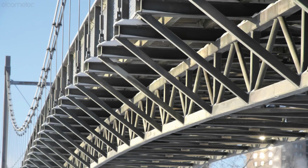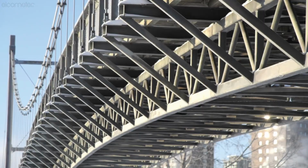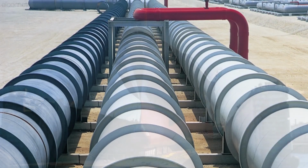Surface contamination from soluble salts such as chloride, sulfate and nitrate ions can cause a premature failure to the coating system, particularly on structural steel. By measuring and monitoring the concentration of soluble salts, we can ensure that the surface is clean enough for a coating to be applied. But how clean is clean? That depends on your coating, the standard you're working to, or a combination of the two.